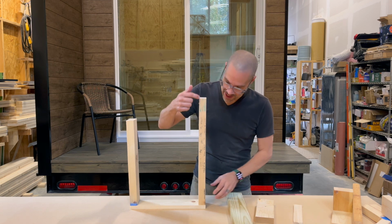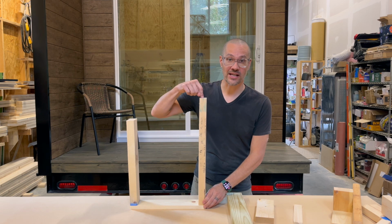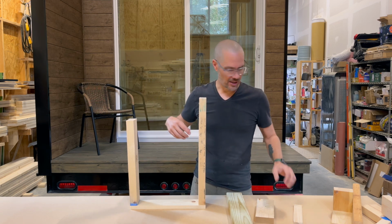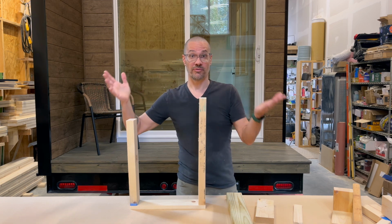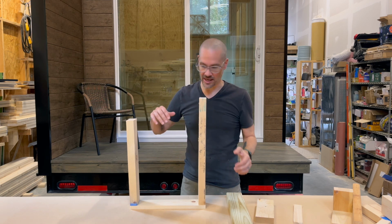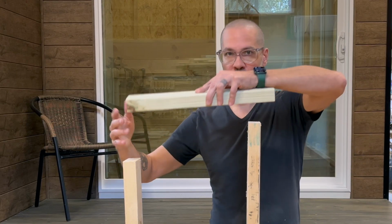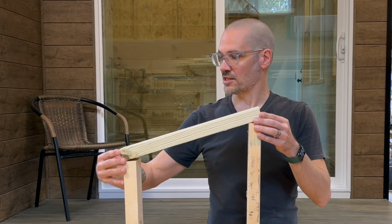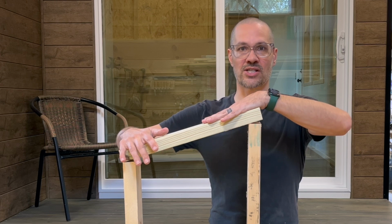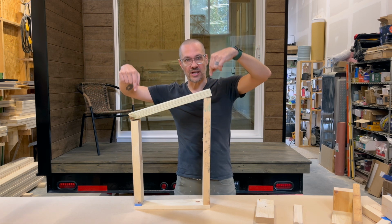Okay, I'm back. All I did was get rid of the other wall here and add another representation of an exterior side wall that gets us all the way up to about what was the ridge height with the gable roof. Make sense? Okay, so this is the way that we tend to build, because it's very easy to build 2 outside walls at different heights, and then we use 2x6 rafters and attach those to both outside walls. All of the weight still wants to go straight down, and both walls share the load.